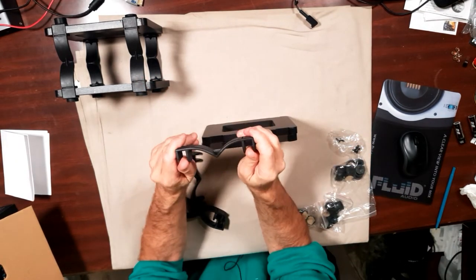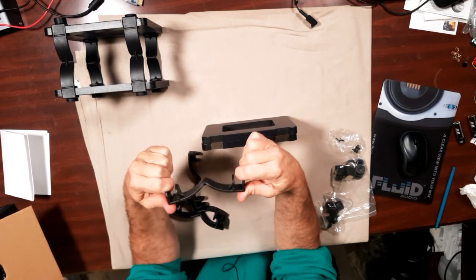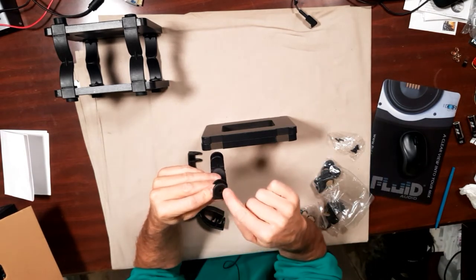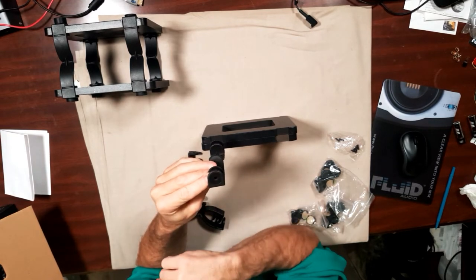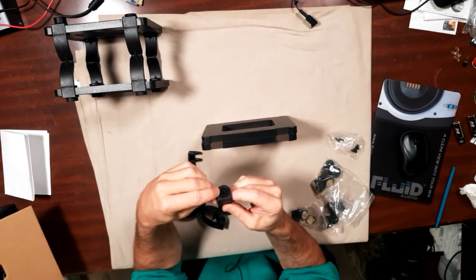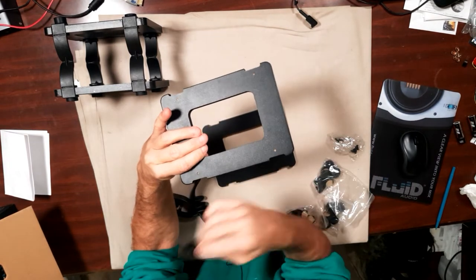On the posts, incidentally, you will find these are polypropylene plastic, so they're pretty flexible, and we did that on purpose for acoustic damping, but also just for ease of assembly. When you mount the rubber feet on here, you'll notice the shape is not round. There's a squared off end, and we call that keying, so that it can only go on one way. If you are going to assemble this with the angle going up, you want the straight side of the key on the front side towards the logo. You want it like that everywhere, on every side.